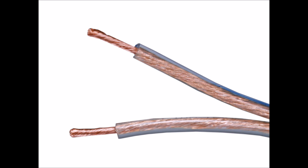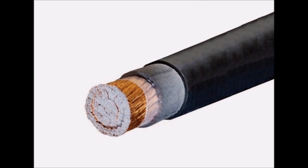Make sure you know a couple of distinctions when working with that kind of wire. The first one is you want to stay away from copper clad aluminum. As you can see in the picture, it's actually aluminum but coated on the outside with copper. Aluminum is not as good a conductor, meaning it has higher resistance than copper, so stay away from CCA or copper clad aluminum wire.